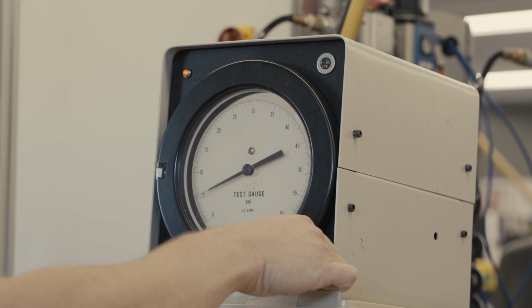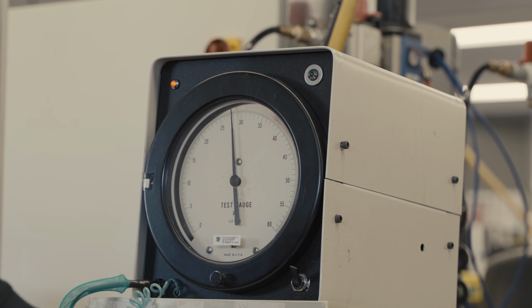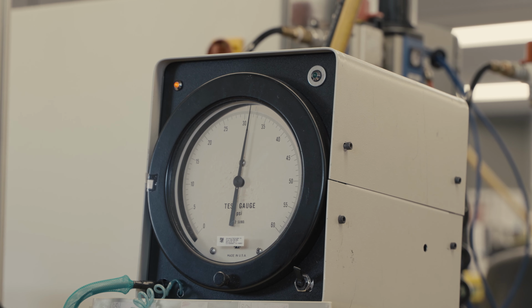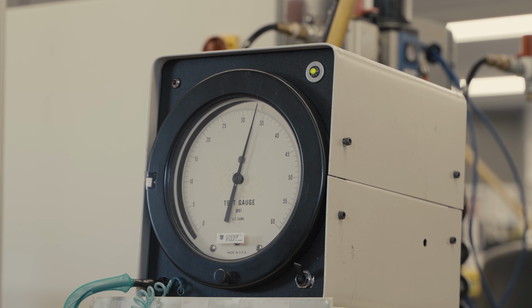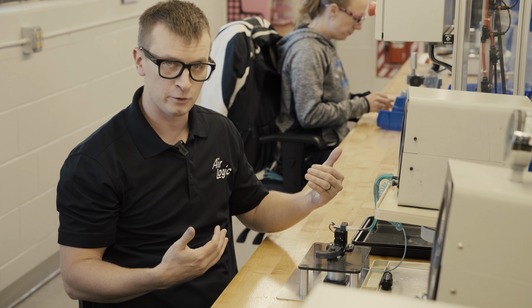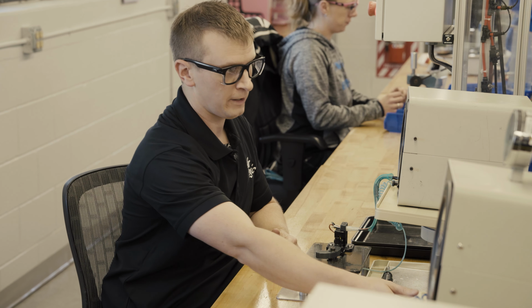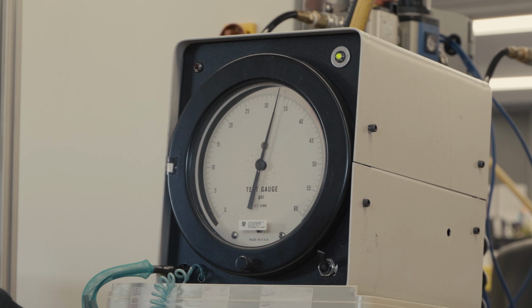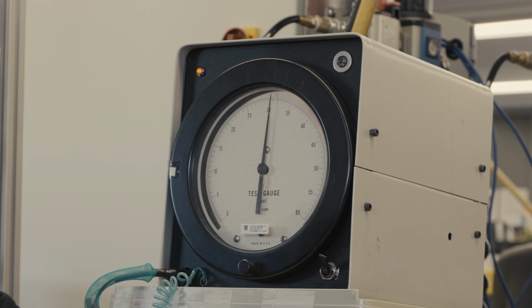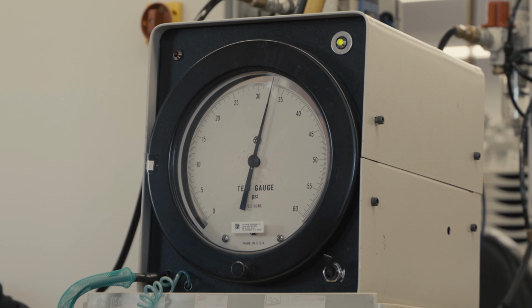Then when we turn on the pressure, scoot this up for a little bit, and turn the pressure up. And after we hit the set point, the terminals flip, and you get continuity through the normally open circuit, and then you get the green light on this fixture. So if I just go back and forth between the on and the off pressure, you can see that those will continue working at that same set point.